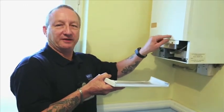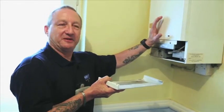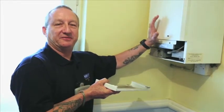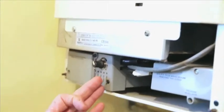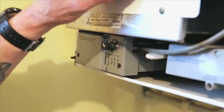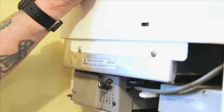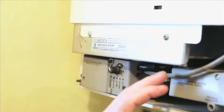But if you see no little flame, you need to check your gas, because there's a possibility you've run out of gas on your meter or somebody has turned your meter off. If you proceed on and go to boiler on, then look through the little window again and see a little flame but no big flame — again, you need to call West Kent, because there's likely a fault with the gas valve.